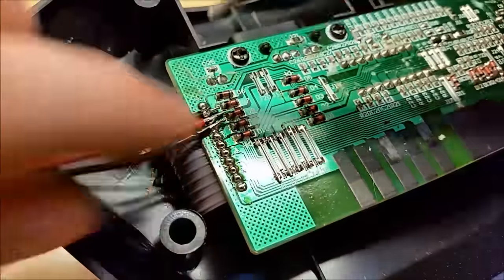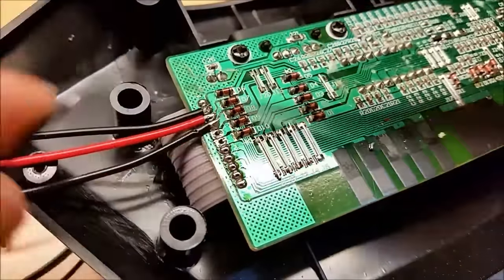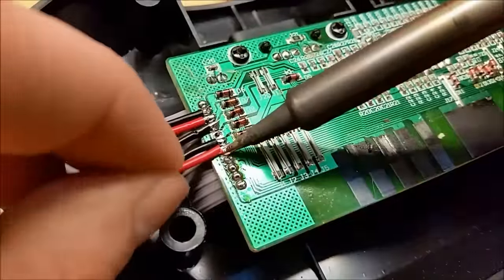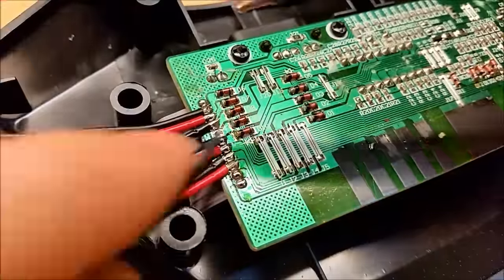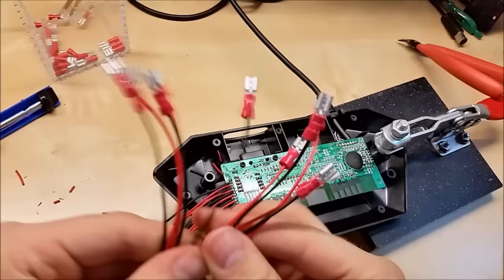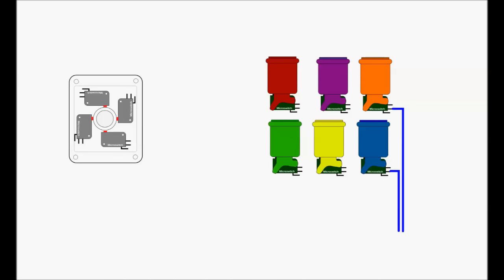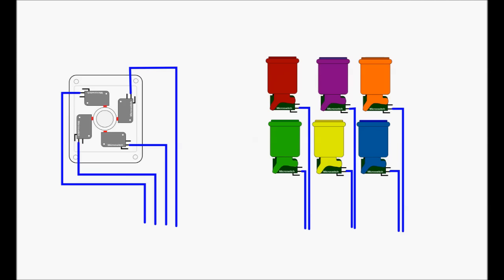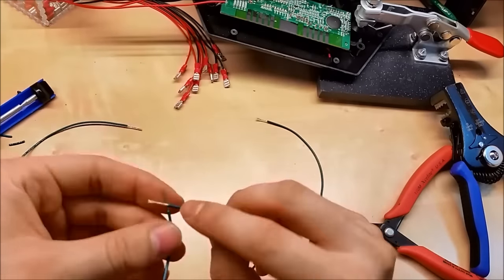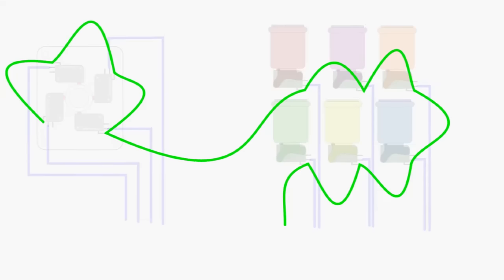It's easier to tin all the leads. I'll alternate colors because I only have three wire colors, and if I alternate at least two of them it makes it a little bit easier to figure out what wire is going where. Add some crimp connectors to the end — you can see in overview we're just adding the signal path to all the buttons and the directions. Now we'll make the ground daisy chain, which will ground all the buttons and just goes between everything.